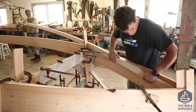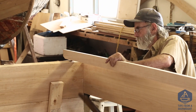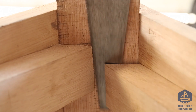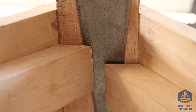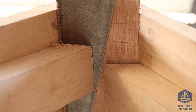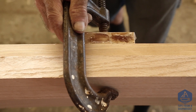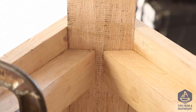Then we'll pick up the chine log, fit it into position, put a number of clamps on it, and twist it into position because it's slightly twisted. We'll look at it up forward to see how it fits — we figured it would require a little fitting, so we'll get it up close and pass a handsaw between the end of the chine log and the heel end of the stem to make it fit properly. You've got to be very careful not to saw into the planking. Once that's done, we can tap it forward right up against the stem heel and add more clamps to get the forward sections into position before addressing the stern end.